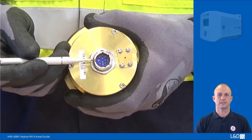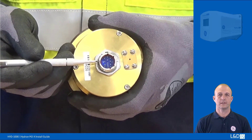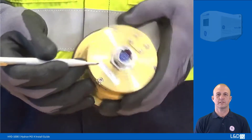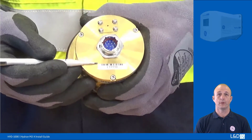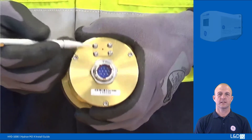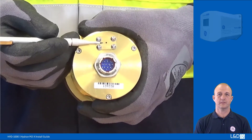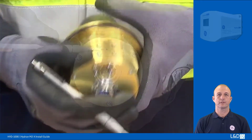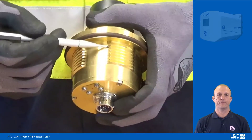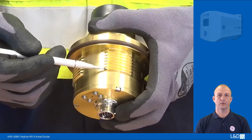On the front of the sensor is the electrical connection. This has a keyway to ensure correct alignment. On each sensor there is a serial number — this is important as it matches the sensor to the parameter sheet provided by GE. There is also the sensor air breathing pore; this must be kept clear to enable correct sensor operation. On the circumference of the sensor body are profiled fins — these were from the legacy fitting procedure and no longer play an active role.